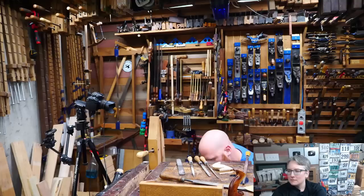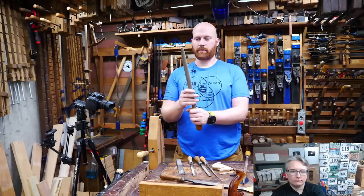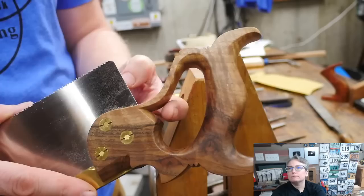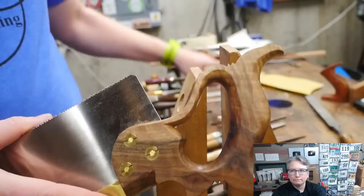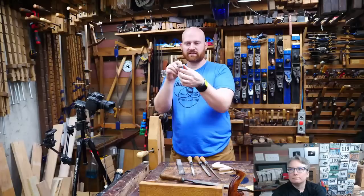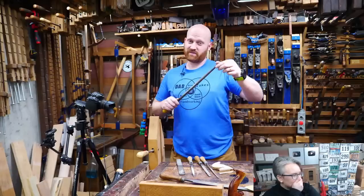Hosman asks how essential is a curved rasp for making saw handles? A curved rasp — as in a half-round — is almost essential. Particularly with saw handles, you need to get into these intricate inside shapes. There's no way you could get a flat file to do it because it's all inside curve. Theoretically you could do it all with rat tail files, but you have to be very careful — it's a smaller radius than you'll ever be filing, so you're only touching in one spot. Let the tool do the work and don't put much pressure into it.